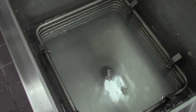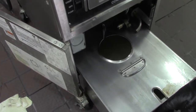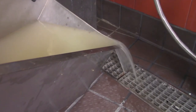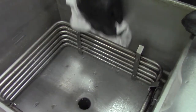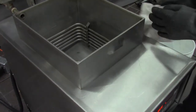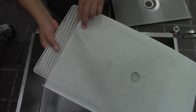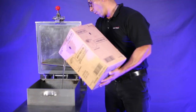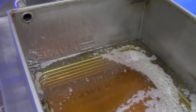Finish the rinsing step by draining about half of the rinsed water into the drain pan or another approved container and discarding it. Then repeat this step for the remaining water. Wipe the fry vat interior, the lid liner, and countertop with a clean dry towel. Thoroughly dry the filter pan, replace the filter, and place it back under the fryer. Finally, add fresh oil to the lower level line.